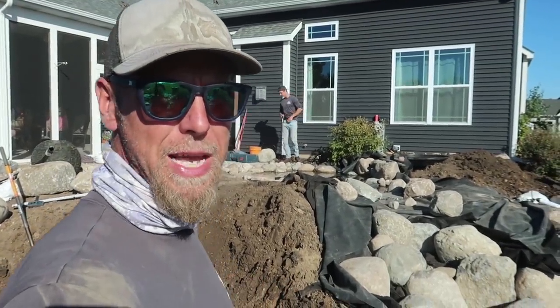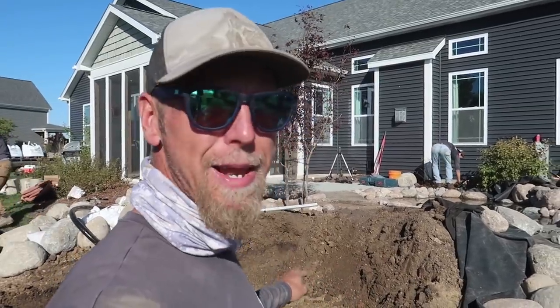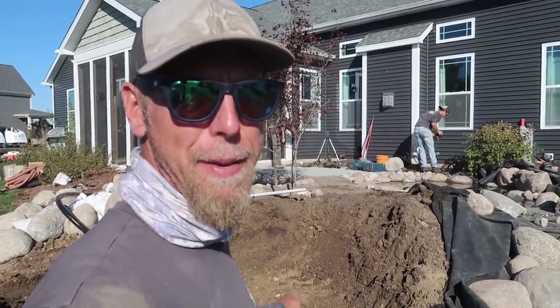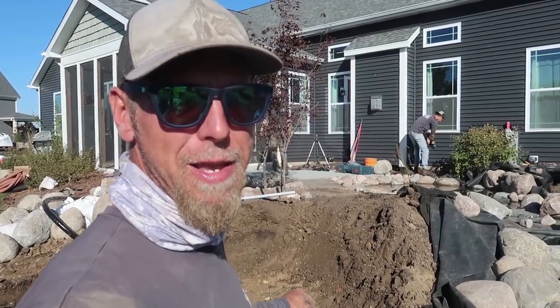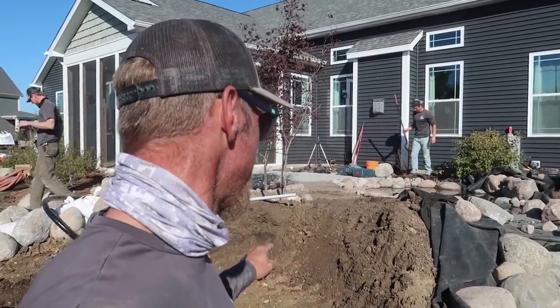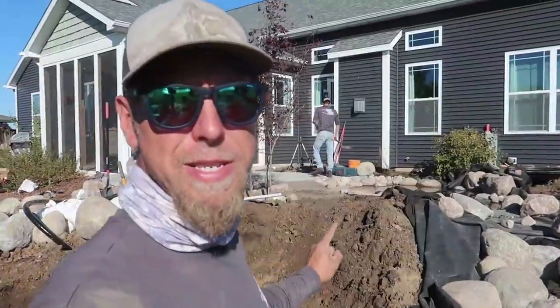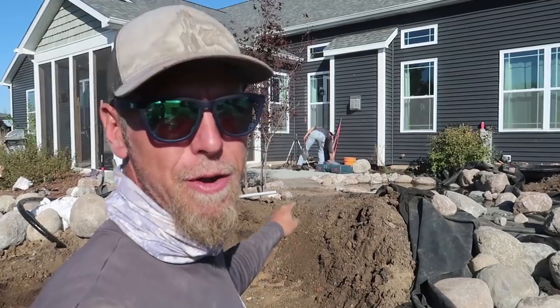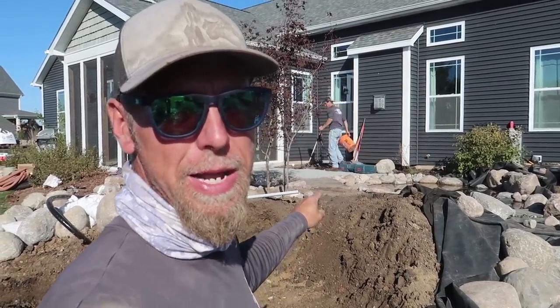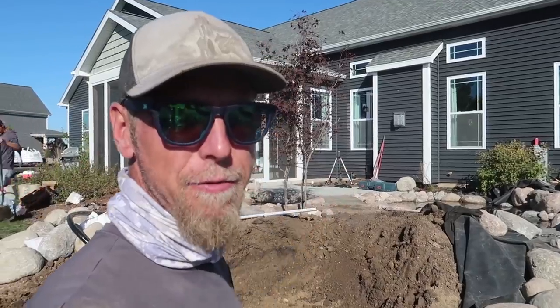So anyways, we need to establish a bottom elevation for the bottom of our bottom step. What I mean by that is I want to make sure that the bottom of my last step entering the fire pit area, okay, follow me, will be at the appropriate elevation. So basically I am reverse engineering the elevations coming down from the bridge element. I took an elevation shot with the transit, figured out the rise of all of my steps, multiplied it by however many I need based on the average grade change down here.